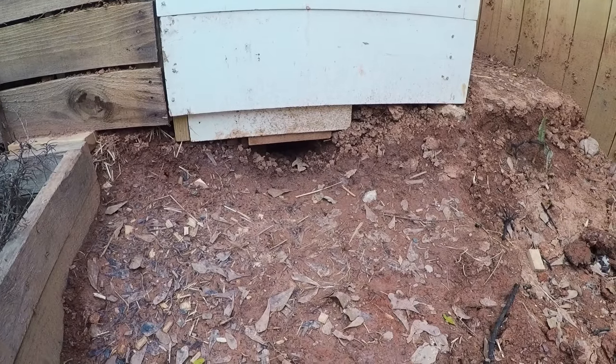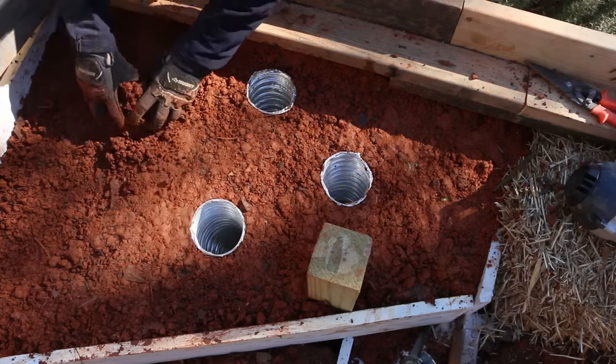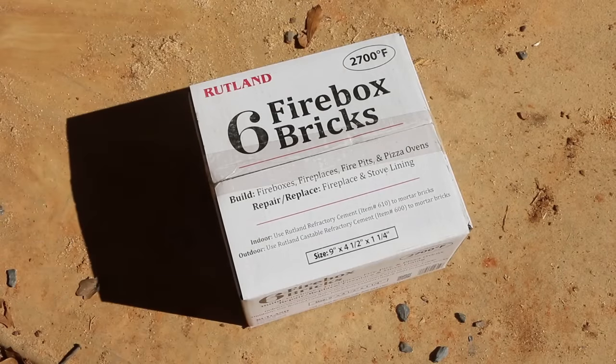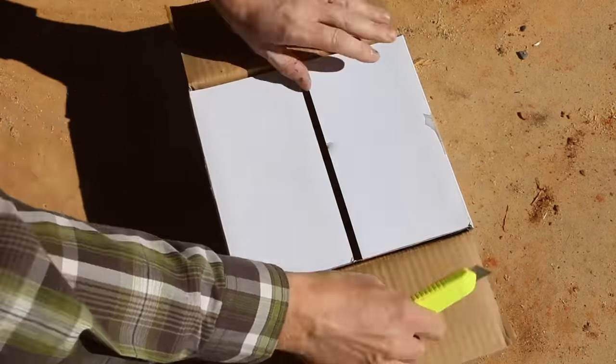Now it's time to start on the furnace. The goal is for all or most of the heat to be absorbed by the mass of soil inside the greenhouse, not the firebox. So I'm going to use some insulated firebrick that I purchased from the local home improvement store. The firebrick is going to form the sides and the top of the firebox, but underneath I'm going to make an insulated hearth using perlite and concrete. Let's open up the bricks, because I want the dimensions of the hearth to match the bricks.